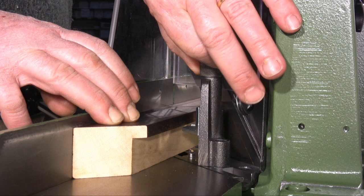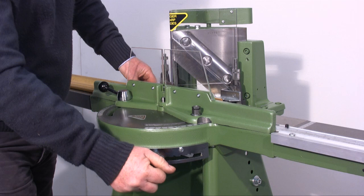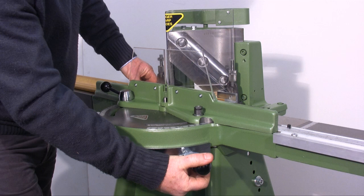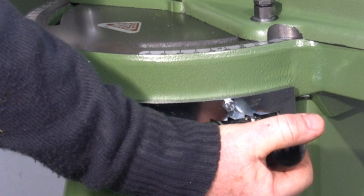The cutting block can be moved forwards and backwards by positioning the lever in the various notches. In this manner, multiple cuts are made possible — a slice of wood is removed at every cut. The last cut has to remove a portion of approximately 2mm, so the pressure of the blade on the wood is less and the cut is therefore perfectly smooth.